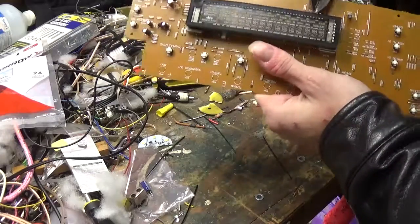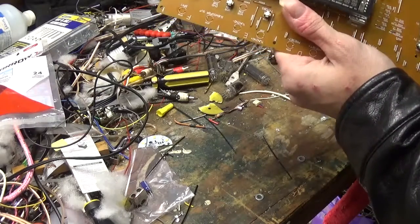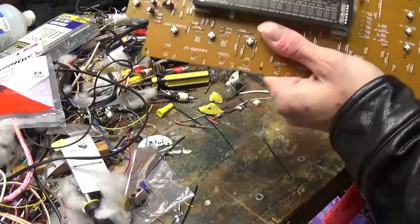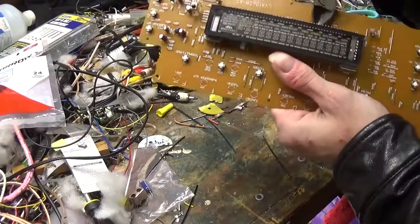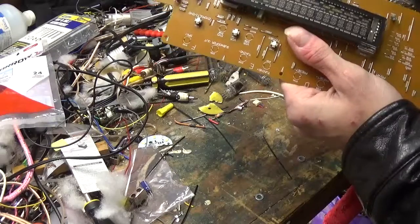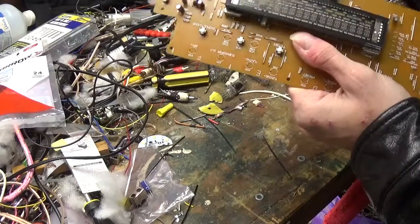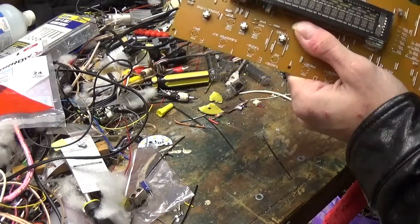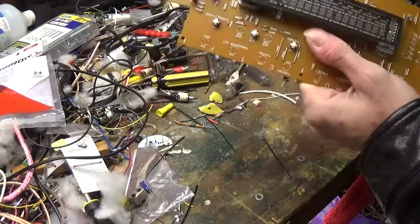It works off the same fundamental principles as a vacuum tube. For anybody who knows about old radio technology from like the 20s, 30s, 40s, 50s, and so on, back then before transistors, they had what was known as tubes, vacuum tubes. Okay? And this is a component of a vacuum tube. Well, a vacuum fluorescent display works pretty much the exact same way that a tube works, in the sense that it's got a heater, it's got a cathode, it's got screens, it's got a control grid, all that.